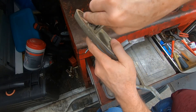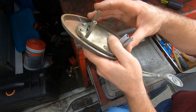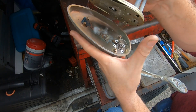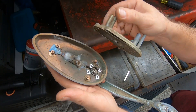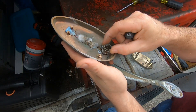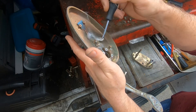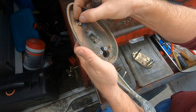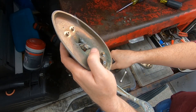It's going to be spring-loaded so kind of hold it down. Let's get our screws off there and let it go gently. There's your spring and the typical spider web gunk. You don't want to take this apart if you don't have to — you really don't want to take it apart at all. While we're in here, go ahead and pull this spring out and pull the cylinder out. Service the cylinder as normal, but this part will pop off so make sure that doesn't disappear because it provides a little bit of spring to the thumb thing.